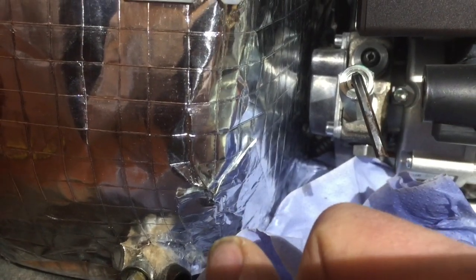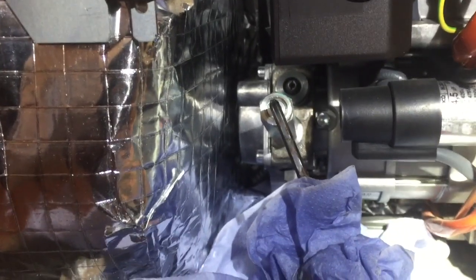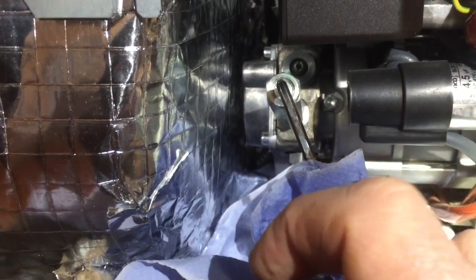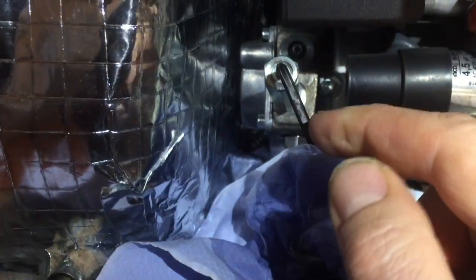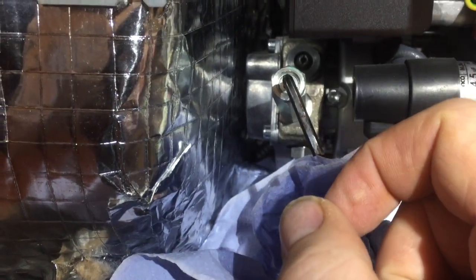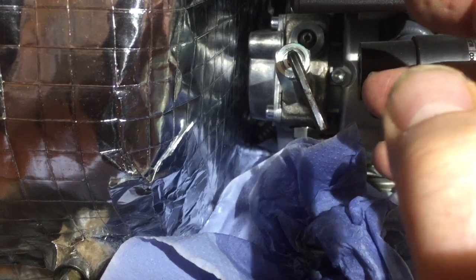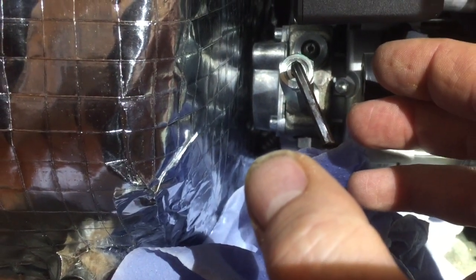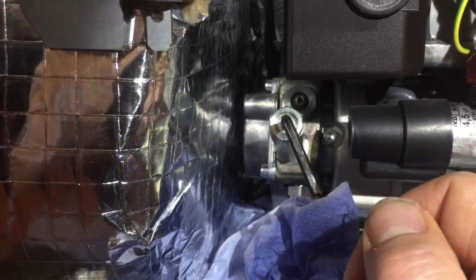Make sure you tighten it properly so it doesn't leak, and wipe all the excess oil off — that's all it was. Just turn the boiler off and on and it'll start straight up. That is releasing — bleeding — the air out of the oil before it goes into the burner itself. There's a little pump behind there. Turn anti-clockwise maybe two turns and you'll see little air bubbles escaping. Hold a rag underneath to catch the excess oil, tighten it back up once all the air has come out — don't pull it right out. This one started up straight away after repeated 10 or 15 failed tries. It's reached its temperature now and shut off.